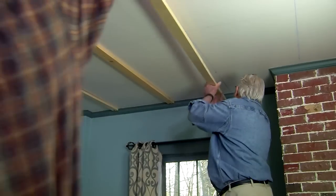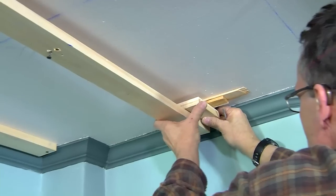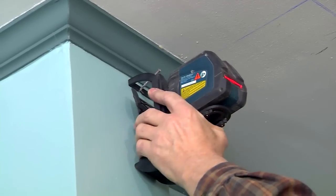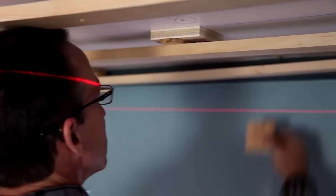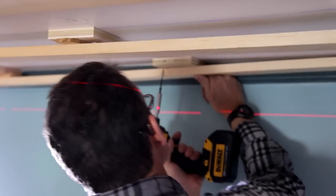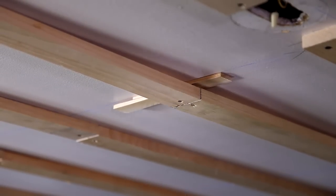In this nearly 200-year-old room, we have some significant irregularities — the center of the ceiling dips nearly three inches. To flatten it out, we insert shims and blocks between the furring strips and the ceiling. We're using a laser level to establish a reference line. While it is possible to use strings, if the ceiling is dramatically uneven like this one, purchasing or renting a laser level is well worth the investment. Most likely your ceiling won't need anywhere near this much shimming — in fact, it may not need any at all.